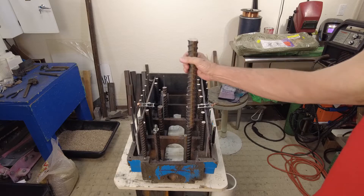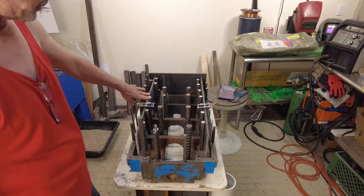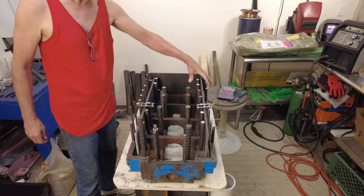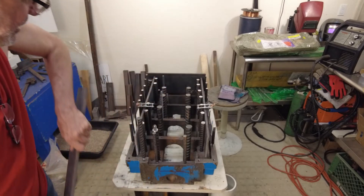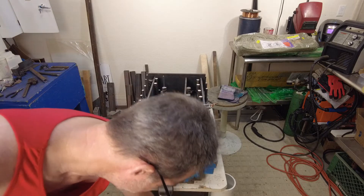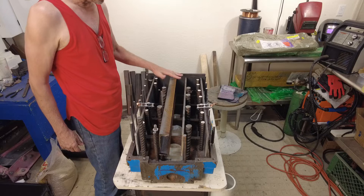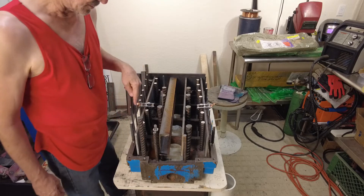The casting is 180 pounds not counting the steel. I have 3/8 by 5-inch steel pieces that are going to be welded onto a half-inch by 6-inch plate - all internal so you won't see any of it. Then there will be two more on the middle pieces using the same idea, plus one piece of 5-inch angle iron raised up slightly for better adhesion. All this will stop this area from flexing in the dimension where the column is - that's the highest stress dimension.